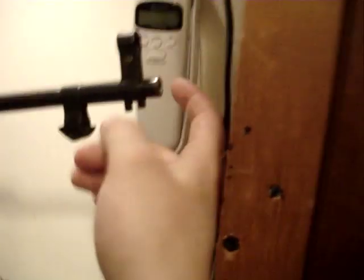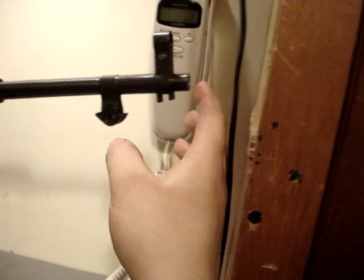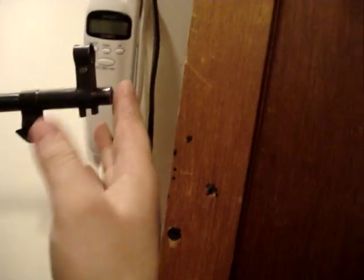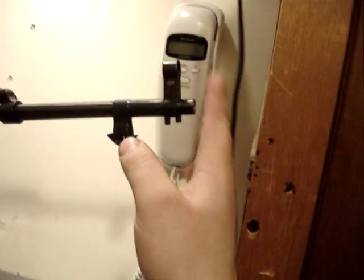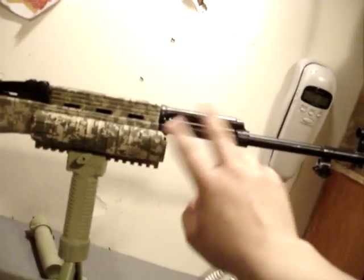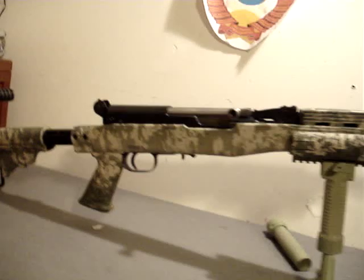And you also want to look for a good crown on the barrel that has no nicks going into it, and generally a good bore right around the last 2 inches. That means it can be mild pitting, just as long as the bore is still shiny. Mild pitting meaning there's no dark spots, the bore is still shiny. But it is okay, let me restate, to have only one or two dark spots, with the rest all being mildly pitted or a good bore. That is not going to affect accuracy.